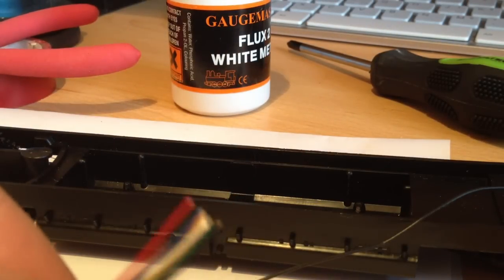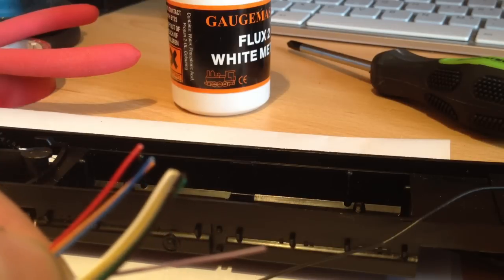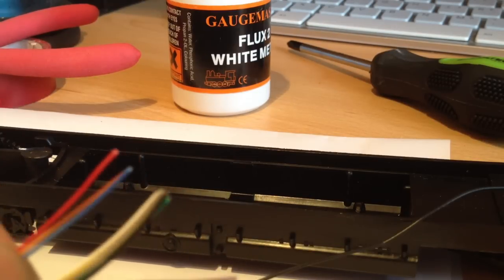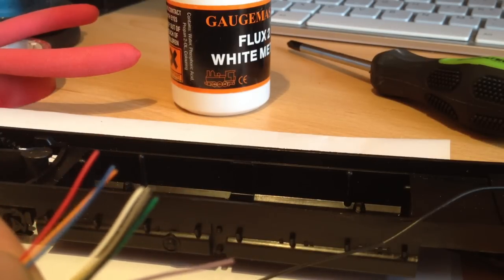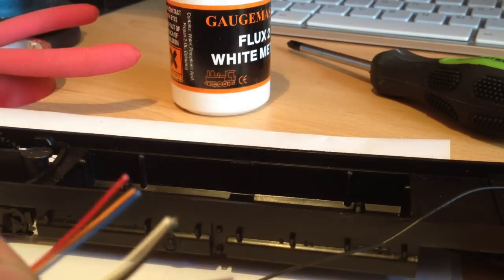All we need to do now is use four cables: the grey, black, red, and orange. I'm going to put extensions on two of those cables - I've already done one. Soldering all ready and we'll carry on. We're left with the connector now. The chip fits into that socket there. I've cut the eight-pin socket off and trimmed the other cables off.